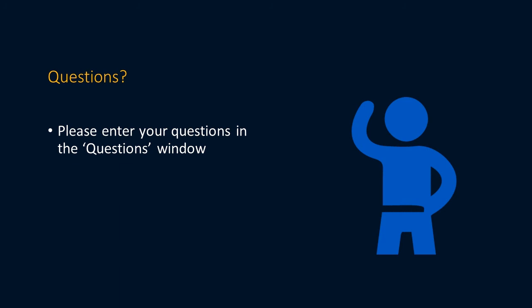And I'll just give a second to see if we've got a follow-up question. Yep, I figured we might have one there, which is, can you daisy chain repeaters? The answer to that is that yes, you can, but you need to understand that every repeater that you add is going to add some time delay. And so if you're doing a 4 to 20 milliamp signal, that's probably okay.